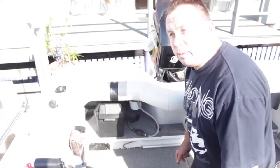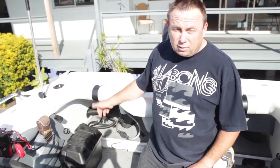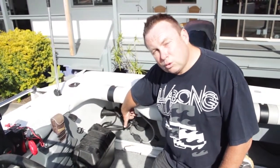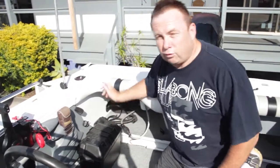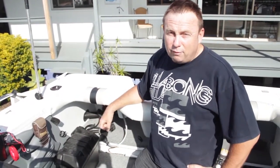Let's have a look at the battery switch just behind the battery box. A good tip is to make sure you turn it off when you're finished with the boat — after you've washed it down and flushed it out, turn it to off. If you've got a little trickle charger, it's not a bad idea to leave it on charge all the time so when you next use the boat it's already got a full charge. We also have the fuel water separator filter — always good to check and replace regularly when you have the boat serviced. We have a primer bulb — always make sure it's tilted upright, because when you squeeze the fuel through, the primer bulb works best sitting up. When it's sideways it only works half as well. So prime up the fuel, battery's on, and then you're ready to start.